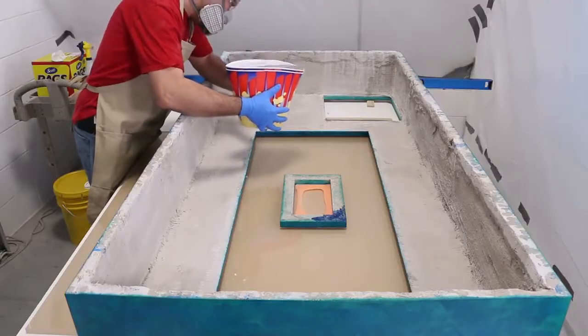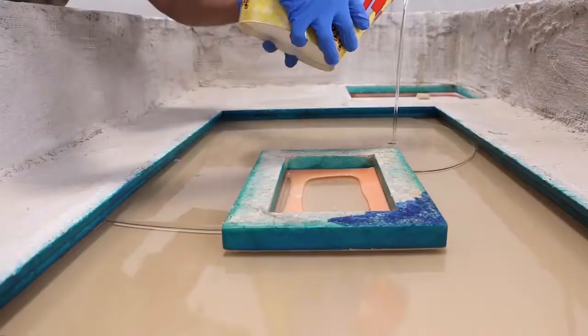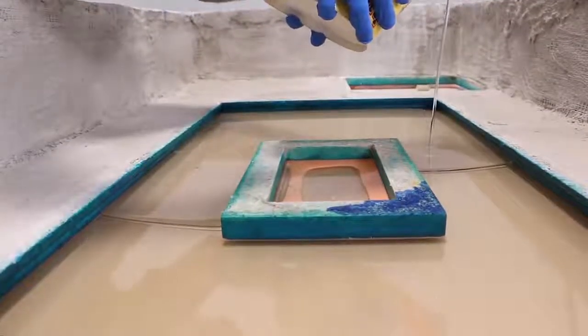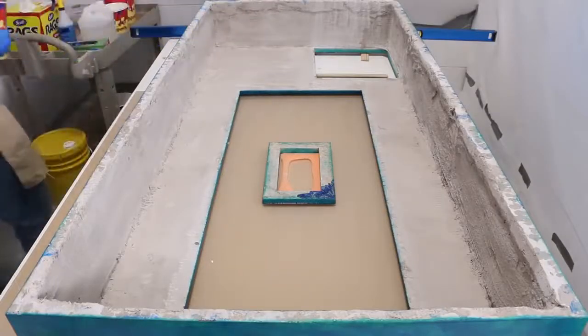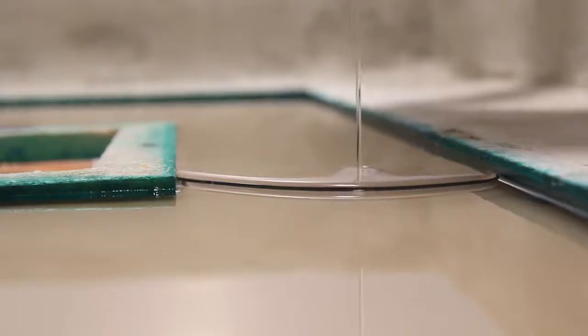When it's time to pour the material, pour it slow and steady, trying not to create turbulence. The maximum recommended thickness is 3/8 of an inch, so we are going to have to pour it in stages. We allowed the material to cure overnight before we pour another layer on top of it. It will be a total of 4 different pours.